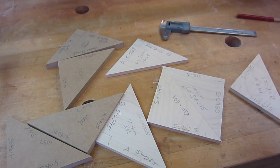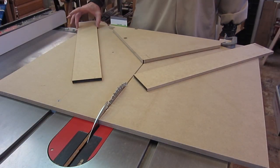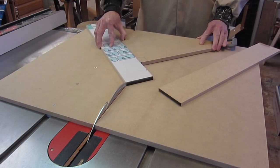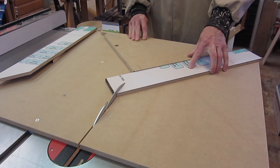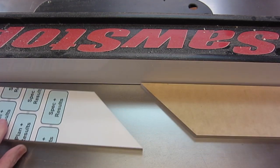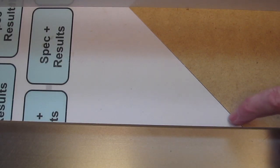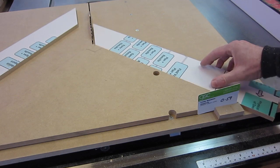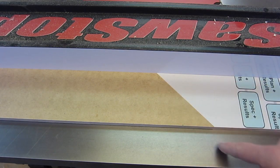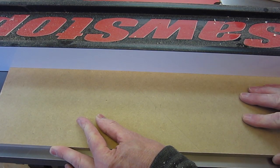So I came up with a more direct method that doesn't involve any measurements or calculations. I've got scraps of wood ripped to a uniform width and I'll cut one on each side of the jig. Then place those pieces against a straight edge like the saw fence and see how they join up. I can see a small gap here whereas up here it's tight, so that's not a perfect 45. Then try a spacer, repeat the cuts and check. In just a few cycles you can get to a perfect joint, which means the jig is at a perfect 45 degrees to the blade. Thicker pieces of scrap will reveal the error more accurately.